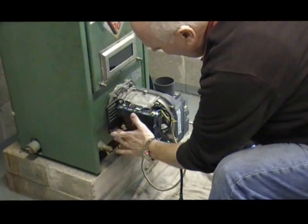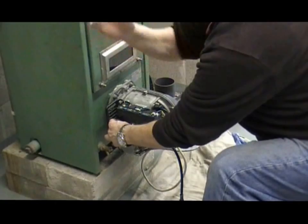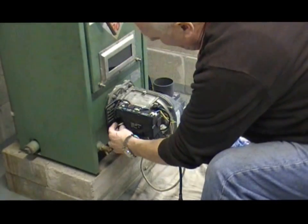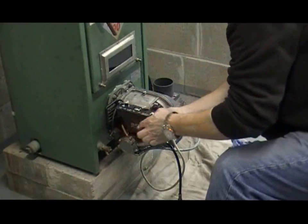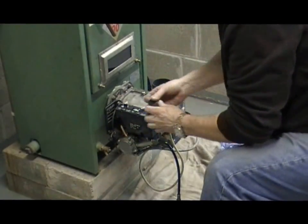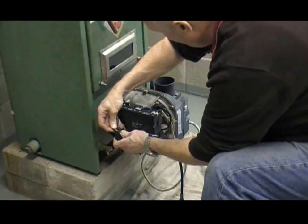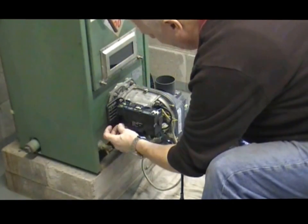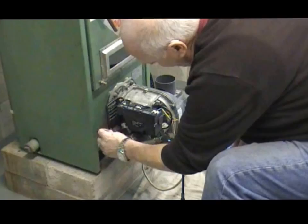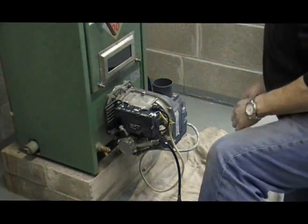The solenoid is positioned over the top of the pump. Quite easily, with the power isolated — we know it's off — we'll just pull off the solenoid and replace it. Just roll back the top, just hand tight. That's the thing there now. We'll turn it back on and let's see what happens.